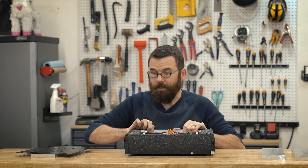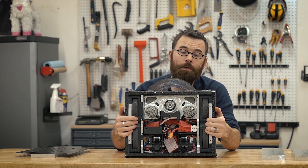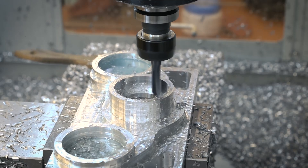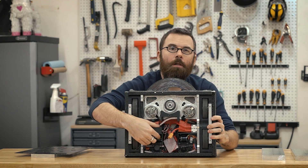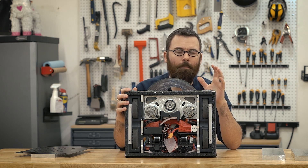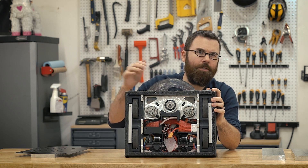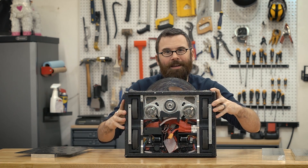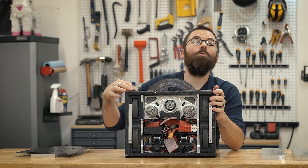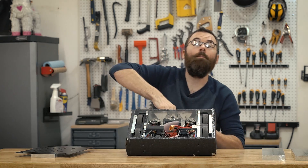The drive blocks were all machined out of solid blocks of UHMW, and the front weapon block was machined out of a solid block of 6061. There are a couple of small 3D printed pieces in here, mainly just to keep wires out and things tidy on the inside. They're just 3D printed PLA — nothing special — and they did kind of break. That rubbing sound you hear is basically just against that plastic. They're really just there to keep wires from getting caught up in the wrong places.